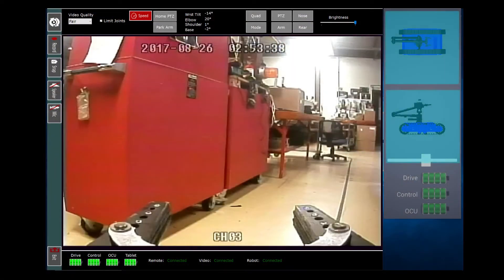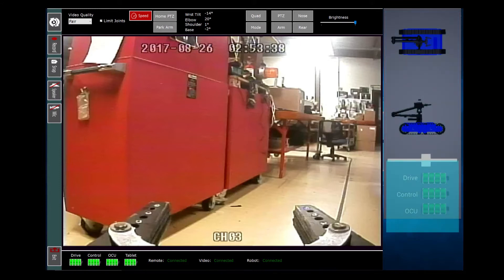On the right of the tablet is a kinematic display of the robot's top and side view showing the position of the arm relative to the chassis. The size and orientation of the display can be adjusted by the slide bar just below the image, and touching the side of the robot you want to see while dragging to rotate. In the same window are the battery life levels shown with the name of each unit being powered. Signal and connection display are located at the bottom of the screen. Video quality can be lowered to increase operational range or increased to yield a crystal clear image of the camera's field of view.